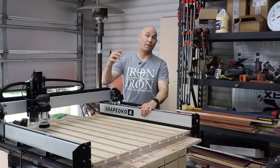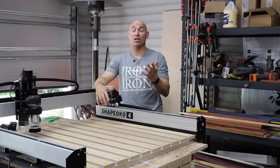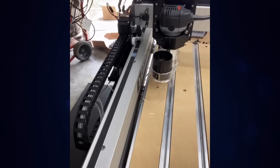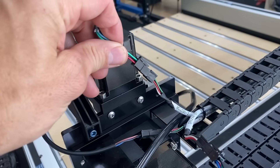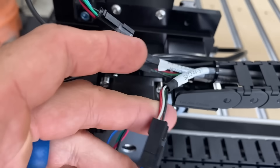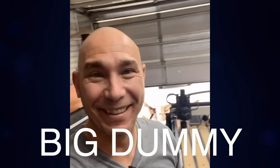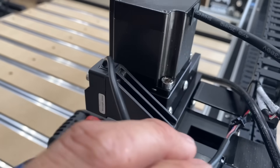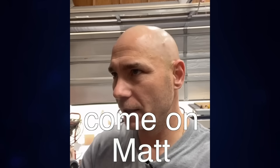So it took me right at five hours to assemble everything. It's fairly straightforward. I'll drop a link in the description to the video that they've put out on how to assemble it. I had a homing problem — an X limit switch problem. I'm a dummy. I had the X motor and the Z motor wires crossed. It's working! It only took about two and a half hours to find that two wires were crossed — clearly labeled. Come on, man.